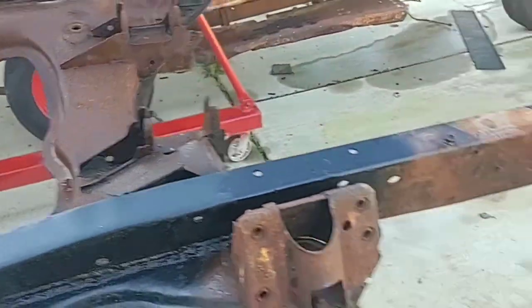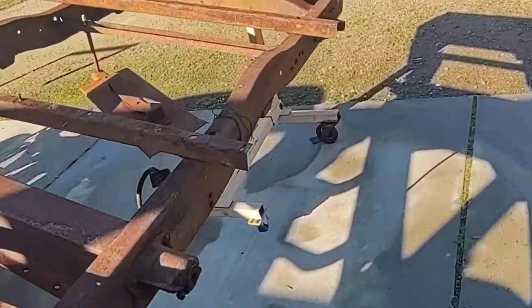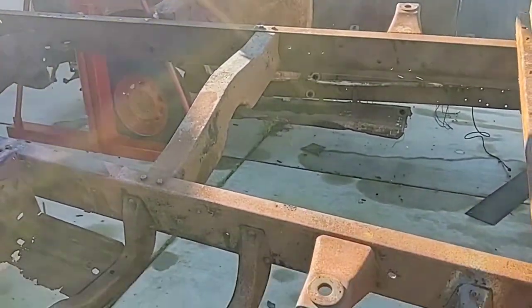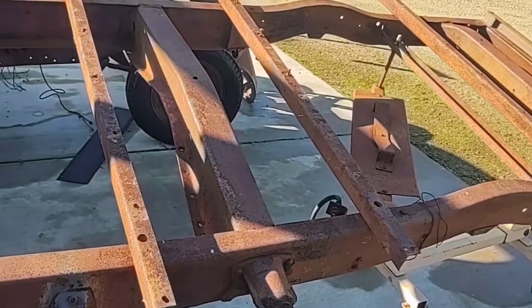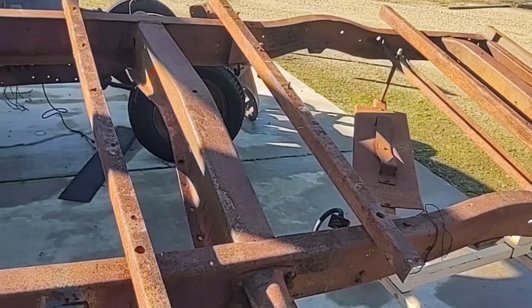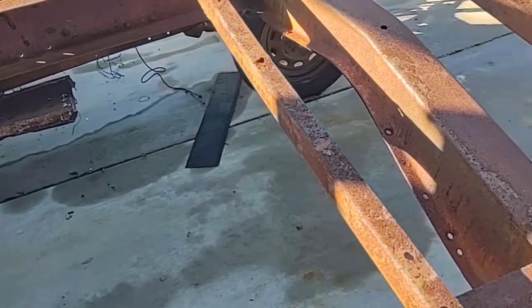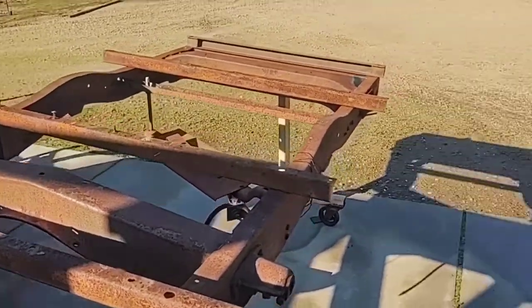This back here is where the back of the cab is connected — that's the front of it. The cab actually acts as a cross-member, tightening up the flexibility of the frame. Back in the early days — the '40s — irregular roads were really hard on old trucks, so the C-channel frame was designed to flex and move with potholes, acting as a form of shock absorber in itself. That's not really necessary on today's nice asphalt roads.